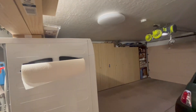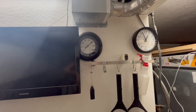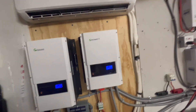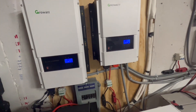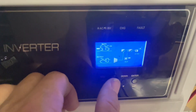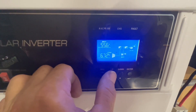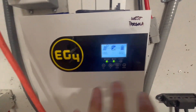One of the things we're doing is we're keeping our garage cold here. Our garage will be around 75 degrees when we go to bed at 8 o'clock, so that helps keep the upstairs cool. It used to be 110 degrees in here. Keeping my garage cool makes a huge difference. With this 12 kilowatt system you can run two air conditioners. Right now we're drawing in 103 amps, 5.75 kilowatts, at 55.6 volts, with a load of 6.66 kilowatts, and drawing 16 amps out of our battery.